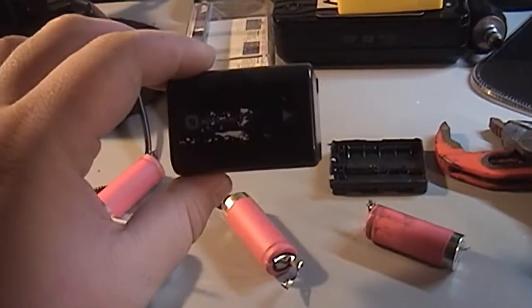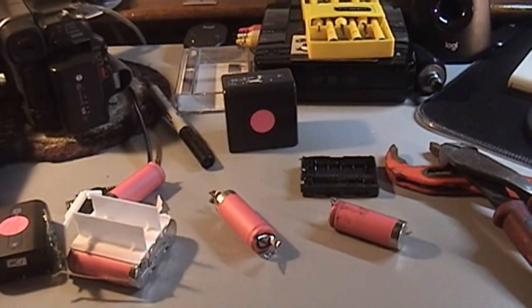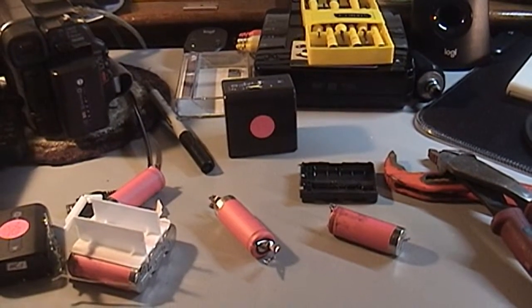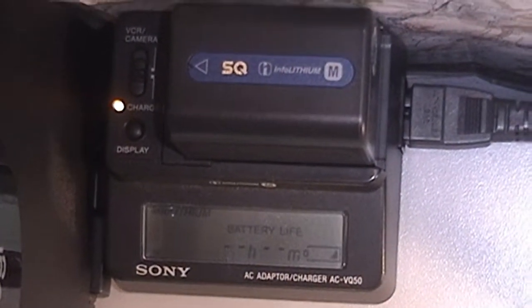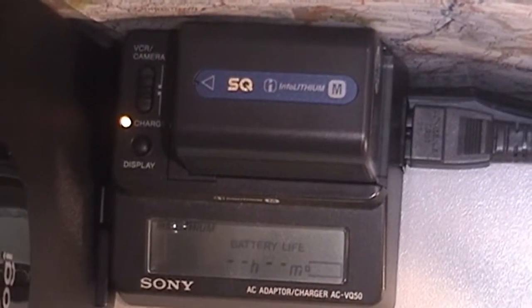This is one I actually just purchased and the pink tag on it was put there by me to note that it's got some kind of internal issue with the cells. This seems to be standard fare for these InfoLithium M-series batteries, the larger capacity models as well as the larger capacity L-series batteries. Here's another one, an NP-F950, also with a pink tag. I've got it connected to a knockoff K-Star DC charger, and I have a genuine Sony battery charger trying to rejuvenate this higher capacity SQ-type InfoLithium M battery, plus two more Sony M-series chargers plugged into the wall.